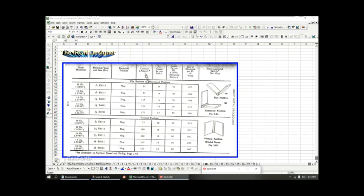Here, what they've done is drop their amps way down. The reason is they don't want spatter, right? They don't want to burn through. They don't want to undercut. So this is how you prevent weld failures, okay? And you could look at the pounds per foot. It's a little bit higher when you're doing this kind of welding. You know, here before it was 0.055 on 10 gauge, now it's 0.068. So you're depositing even more metal into your fillet welds when you're doing these kinds of welding.